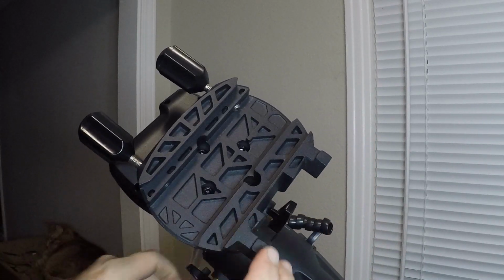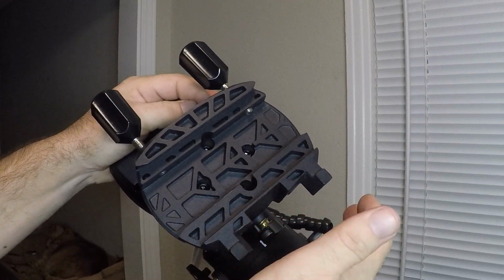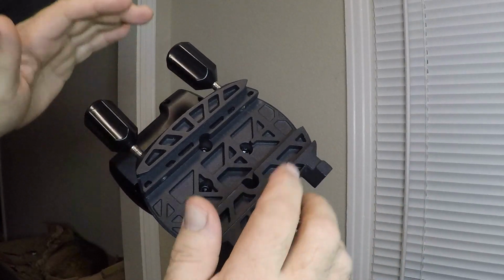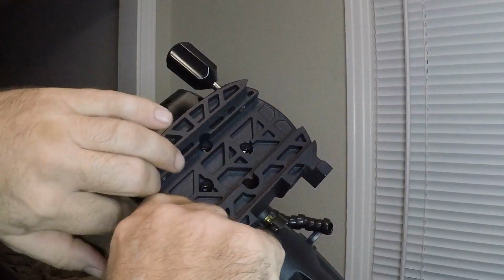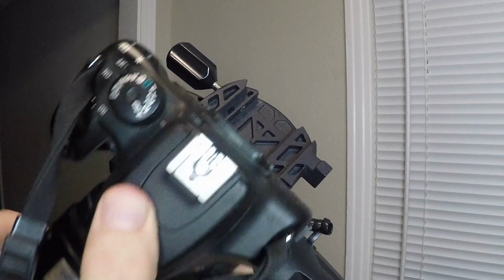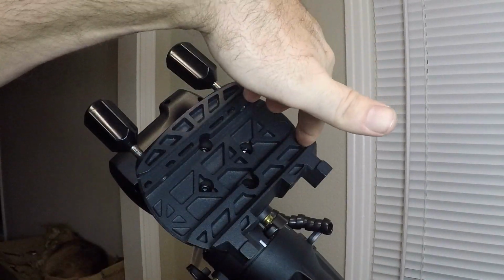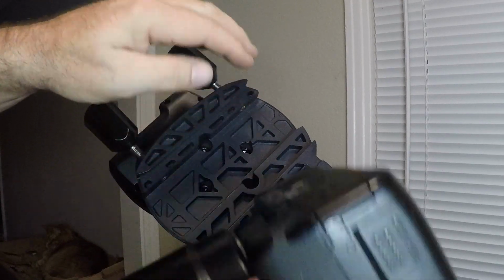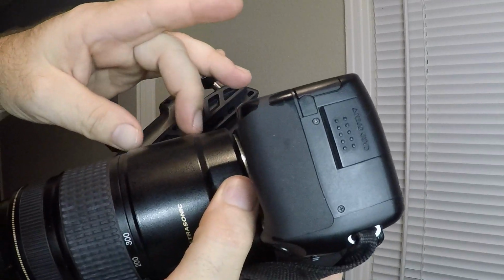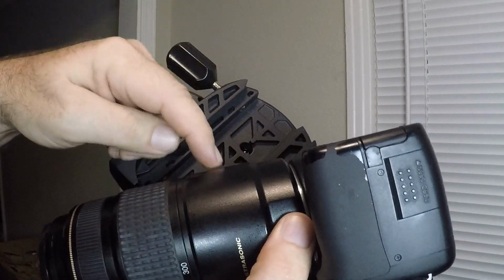And this astronomy crowd is not quite as fond of mechanical dimension drawings as the machinist community is, but it's pretty simple. So what I want to do is I don't want to use a lower rail. I'm going to use the upper one, because the camera's kind of wide. You may as well take advantage of this high one. Okay, so I'll just make a piece of aluminum that'll fit in here, and the camera will screw down to it. And it turns out this part of the camera is a nice flat plane, but this sticks below that plane a little bit, so I'll need to cut a pocket out of that piece of aluminum, and I'm going to machine it to make clearance for that.